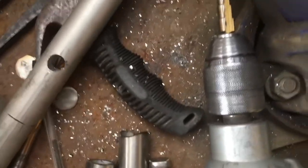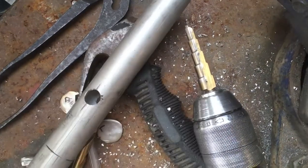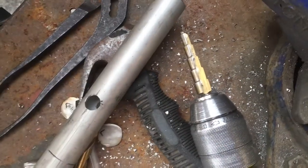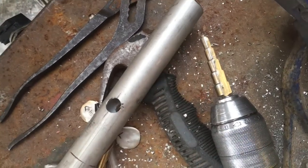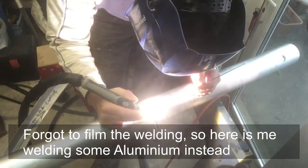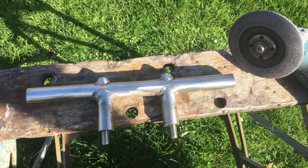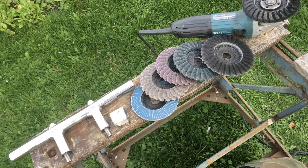These step drills work really well on stainless. This one's broken, as are most of my bits and pieces, but that's because I use them - they break. But these ones last quite a long time and put up with a fair amount of abuse. And then to polishing. For polishing stainless steel I use these scotch bright discs and then a final flap disc that gives it a polishing with a sort of clay type stuff. It's not a mirror finish but it's pretty good.